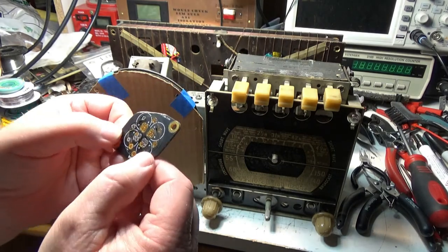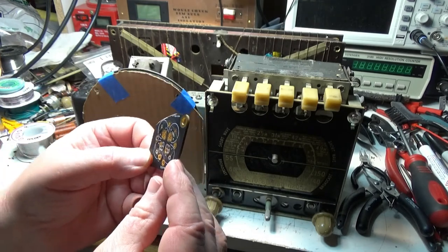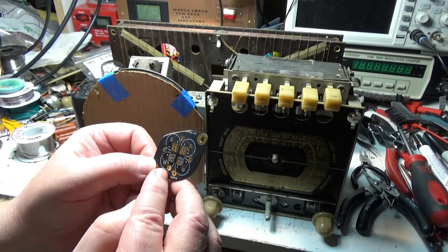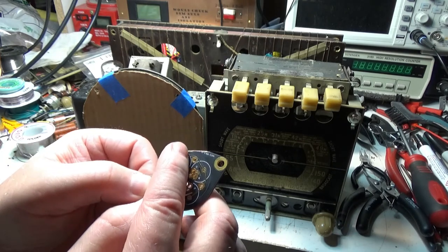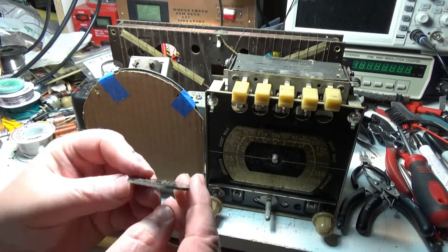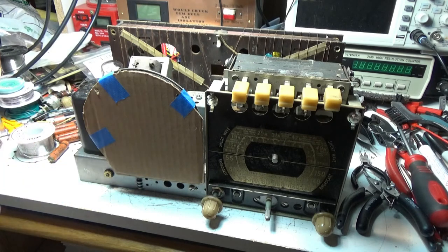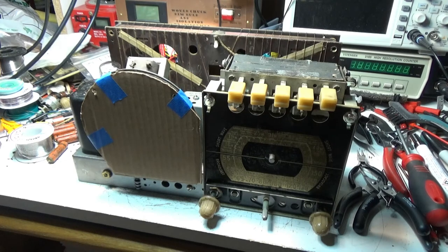I guess a guy could put an electrolytic here because you can see the trace goes from here around for the ground side to here. So if you broke the gold trace right there, then you could connect all your grounds and keep your electrolytics on this. But it's not very common that the can has two grounds on it. So I find it very strange that it would have two negative terminals on that electrolytic, the original one that came in there. I've never seen that before.